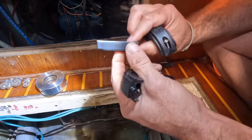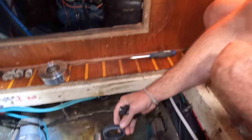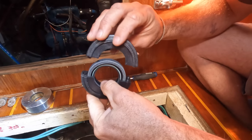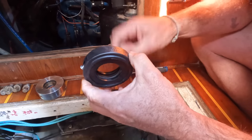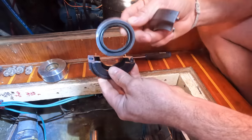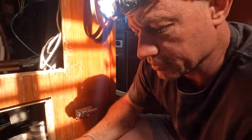This is just a spare lip seal. If for some reason the unit I've installed fails, I have another one on the shaft ready to go. This is just a carrier for the lip seal that'll be on the shaft — it tightens up, shouldn't spin on its own, and just spins with the shaft. If you ever need a spare seal, it's on the shaft ready to go. I probably wouldn't have minded having two but I had a budget to work to — this wasn't a paid or sponsored product.